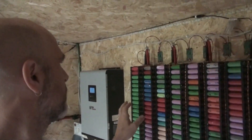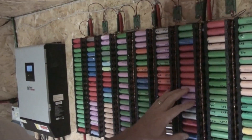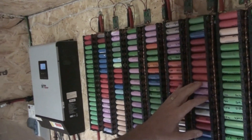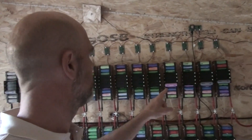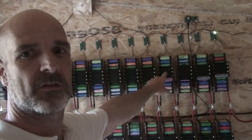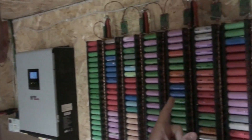I've noticed that one of my packs gets a lot lower than the others right near the end. It's this battery on the wall - the seventh one. So what I need to do is boost this pack up a little bit, the same way as I have for the other packs on the wall, where I added these little four-cell holders so I can put some extra cells in to boost them up. I need to take this pack off the wall and solder a couple of those four-cell holders on there.